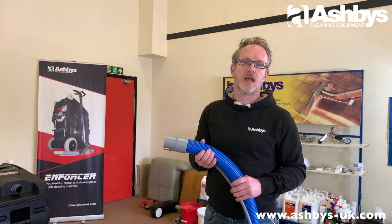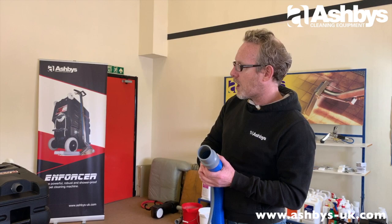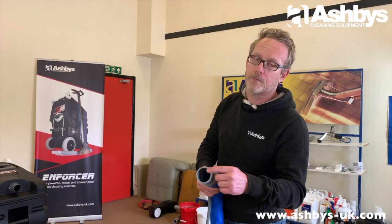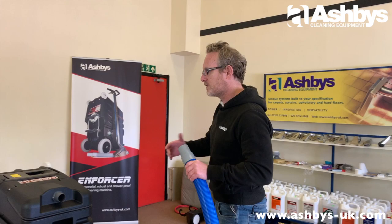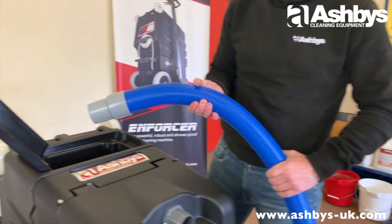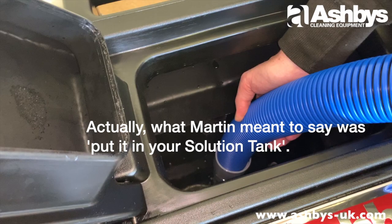The reason we use a two-inch hose as the primary hose is to help maintain vacuum. The cuff has a two-inch thread and two-inch slip. Before pushing a cuff onto the machine, warm it in the warm water of the solution tank for about 10 seconds, especially if hoses have come out of a cold vehicle, to prevent the cuff from splitting. They become quite supple within about 10 seconds.